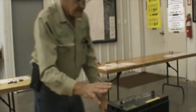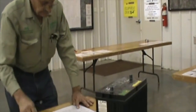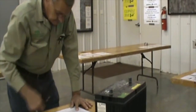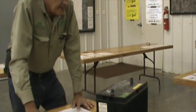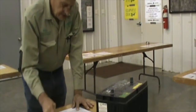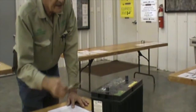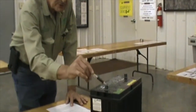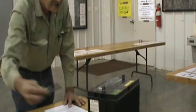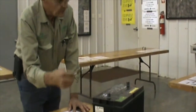The next component is rather simplistic, everybody is familiar with it: a battery. The first question: CCA is an acronym for constant cranking amps. That is incorrect. It's an acronym for cold cranking amps. The next question: connecting two 12-volt batteries in parallel will double the voltage. If you connect two batteries in series, you'll be adding voltage. Connecting in parallel will only increase the amperage, not the voltage.